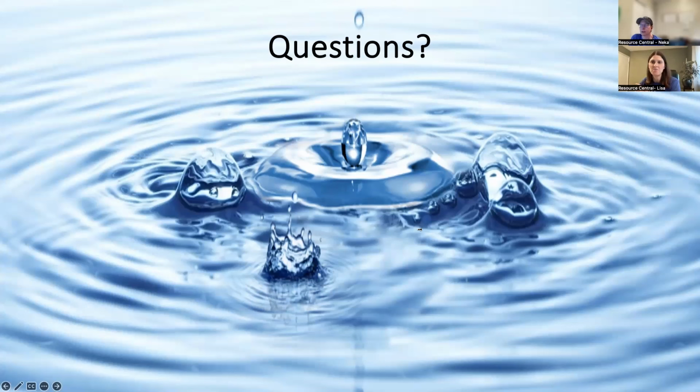Have you heard anything? I concur. In fact, really, it's the valve that makes the zone. To make a sprinkler zone, you have any number of sprinkler heads. I've actually seen a zone just be one head, but typically you have at least four heads per zone. And then at HOAs, there might be hundreds of heads on one zone. But typically at a house, you have like, I'd say 4 to 10 heads on a zone.